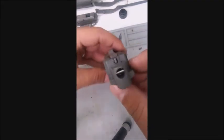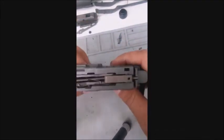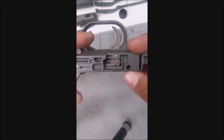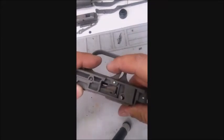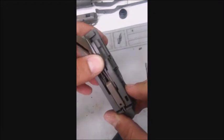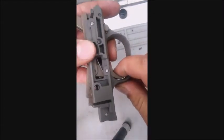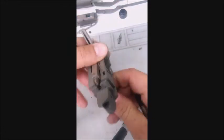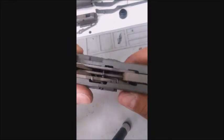So there you have it. And then the hammer spring, obviously, is right there. Then there's a couple other springs. This is going to be your trigger spring right here. It's part of one of them. Actually, no, this works on this Sear. That's the Sear Spring. Your trigger spring's hidden in there. There's one back there. And then there's also a few other springs in here that work in unison. Then there's one in the front for the Sear too, and it's really, really tricky.